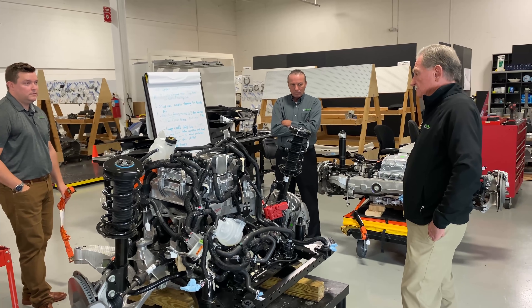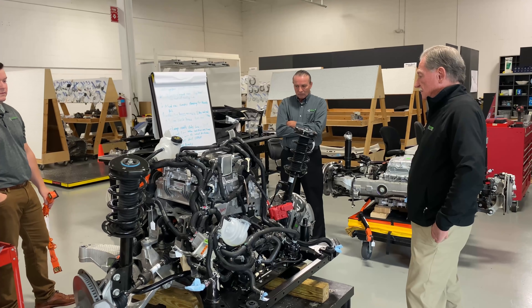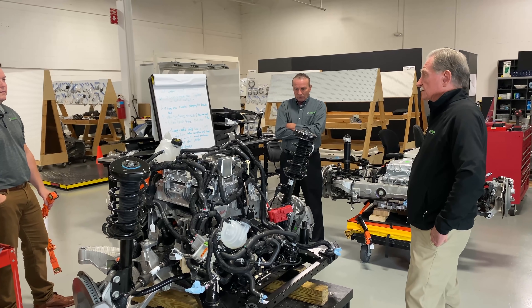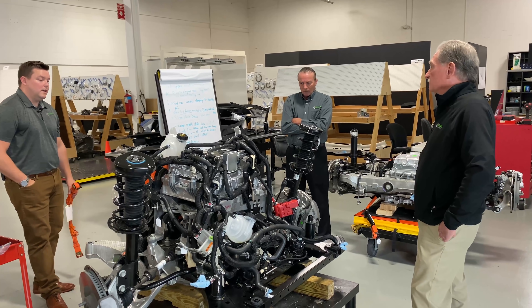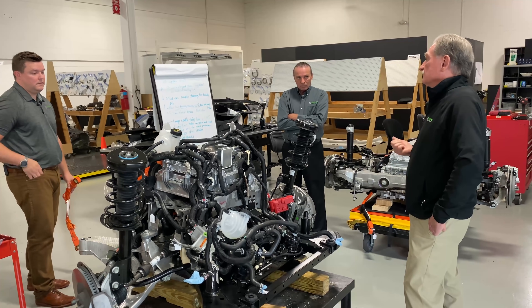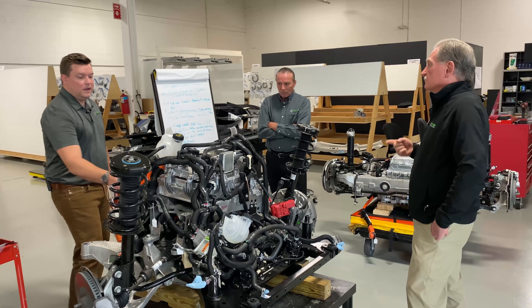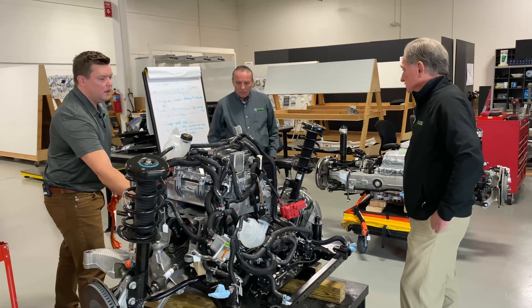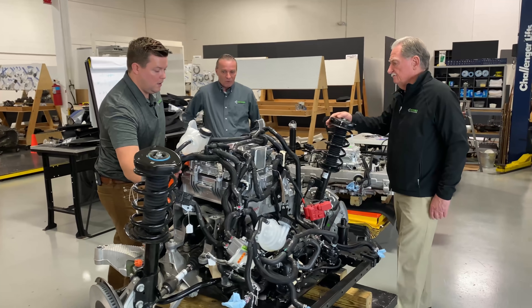Is this the same as the deal where they bought into Rivian and then walked away? It's got to be. Look at how they mount the front motor — the front induction motor is hung just like you'd hang a four-cylinder engine. Every front-wheel drive four-cylinder powertrain for Ford and mini-OEMs hangs off the rails. They're using this large cross-car beam to hang off the rails, two large isolators tucked up into that beam, and a torque strut to react the torque load in the lower cradle. This is how OEMs have mounted powertrains in the front of vehicles forever — nothing wrong with it, but there's no ingenuity.